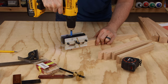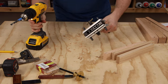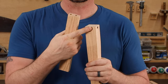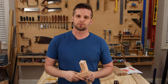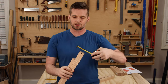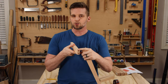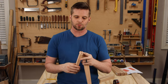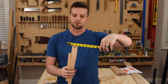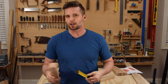You may be wondering why the hole is so close to the top — I screwed up. I did measure 3/8 from the top, which is the right measurement, but I used a bent tape measure end, so it came out closer to a quarter inch. The correct measurements are 3/8 of an inch and then 3/4 from that. Also, when measuring with a tape measure, don't latch it on the end — skip to one or two inches and measure from there for much better accuracy, then subtract that amount from your final measurement.